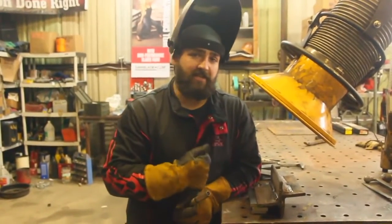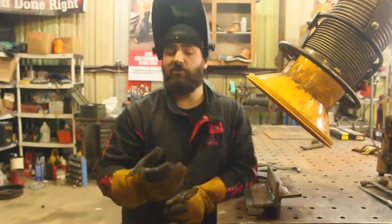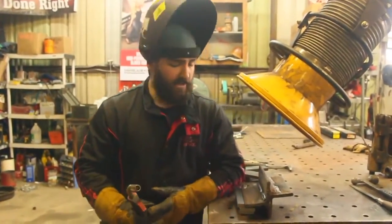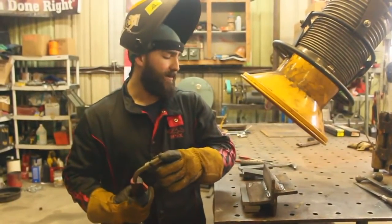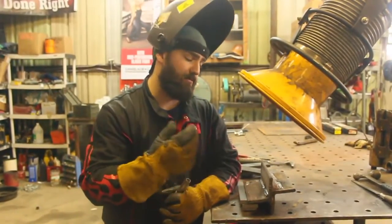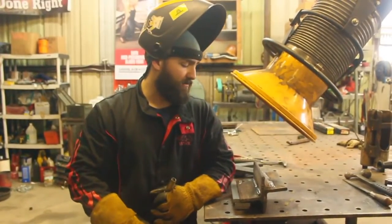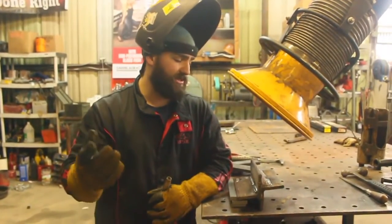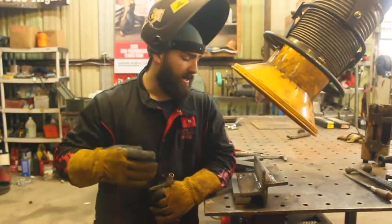If it's punching against the plate, and it just seems like it's not grounding right, that's usually your volts. If the wire is burning off too far towards the nozzle and kind of dripping, you want to turn that wire speed up, which is going to bring that wire out faster. And I know that's a lot, and that can be overwhelming, but essentially what I'm saying is, just like on any of Chucky's videos, he talks about, just pay attention to what you're doing.